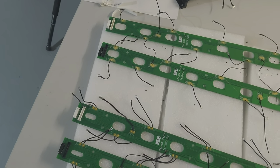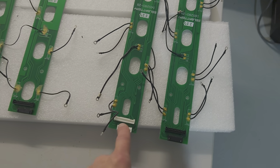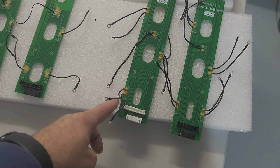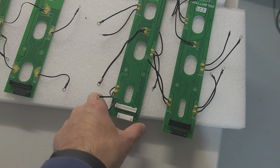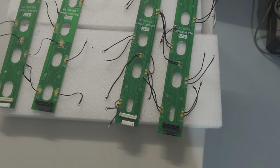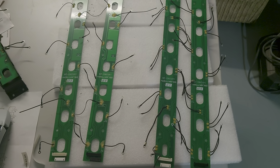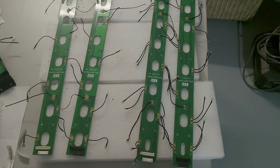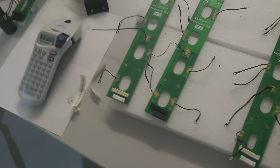So what is the difference between those two types? Quite easy to explain: functionality-wise, the new ones have two leads. One is for sensing the voltage between the cell, and the other is for the balancing current from the active balancer, which is an option in your case. Some of you might not care because you don't have the active balancer option.